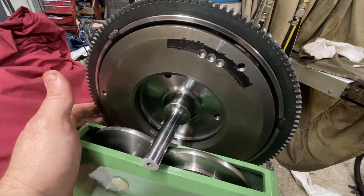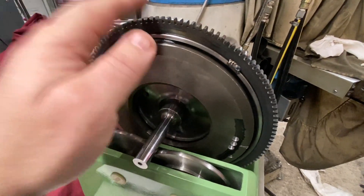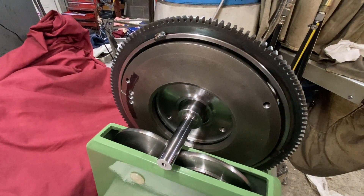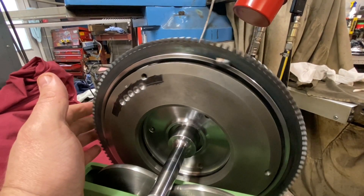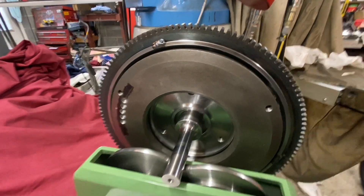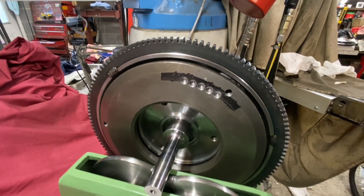On this one I've changed to a bigger drill and drilled three holes. You can see now that it's responding much more slowly, so we're getting quite close to the balance point. We'll put it the other side just to make sure it's responding evenly — and you can see it's very slow. So we need to be very careful now that we don't drill too far past that point. I've drilled two more part holes — not the full depth. And we can see now I've got balance. So that's now balanced.